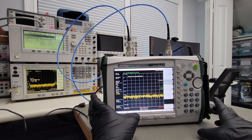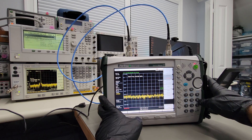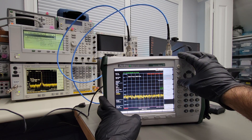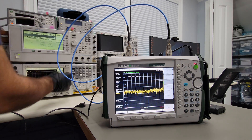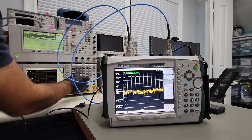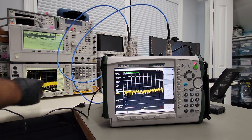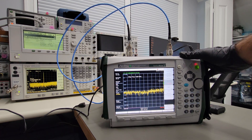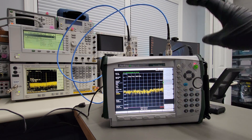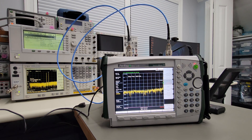Let's go to a higher frequency to make sure microwave operation is functioning as expected — starting at 6 GHz and stopping at 7 GHz. Changing the span on the external analyzer to the same range, you can see we have a nice signal here too and it's sweeping as expected. I would say the Anritsu is fixed — all the buttons seem to work, and that connector is also fully repaired. This instrument has been saved. Thank you once again Alex, thank you all for watching, and stop in next time.